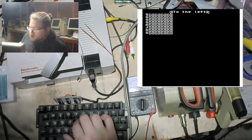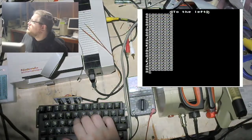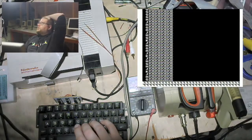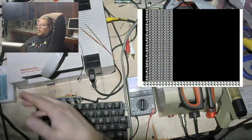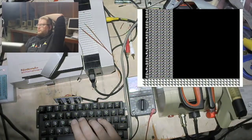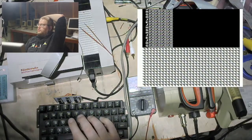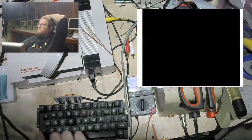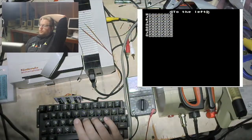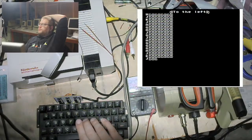And no bingo, interestingly. Huh. That's actually very, very strange. Tradepsy said, did you need glue logic to remap the FDCIO? No, I'm going to do it all through the GAL. I have enough remaining resources on that GAL to handle it, but we haven't done that yet, so. And this has now gone insane. Yeah, so that is not toggling that register at all whatsoever.